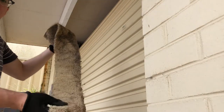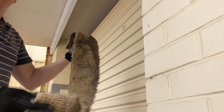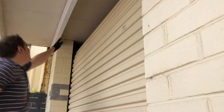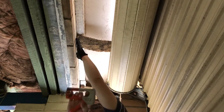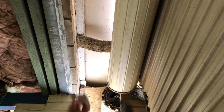The best way to start is by cutting yourself a small offcut of carpet that's easy to work with. We're going to use this to measure how long we need to cut the rest of the carpet — long enough to fix to one side, drape over the door, and attach to the other side. I can grab this staple gun and simply tack it up, then measure any excess and cut it off. That gives me the length to cut the rest of my carpet to.